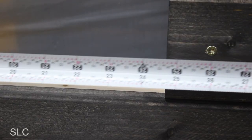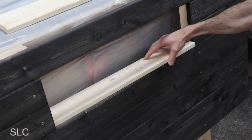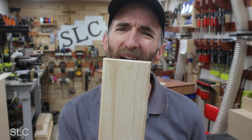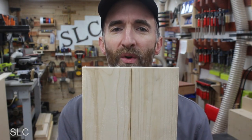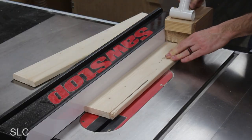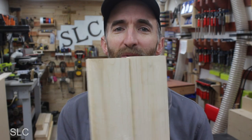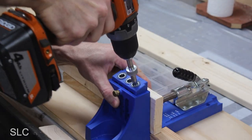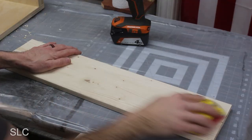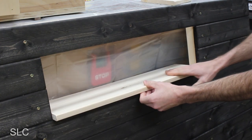So heck yeah, I'm going to build a bookshelf. Let me measure this out and I can cut the first layer and we'll go from there. Now using just one of these shelves for books — it really isn't wide enough for a book. But if I take two of these and join them together, then it should be just right. I'm actually going to rip them down on a table saw to about three inches a piece, and that will allow me to join them together really nicely so it'll be nice and flat. With the shelf done, it slides nicely into place and gives a good ledge to put the books on.